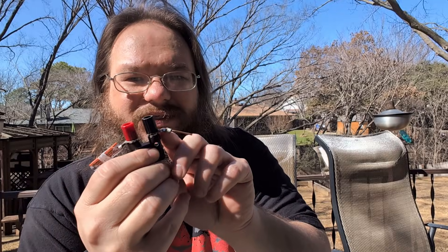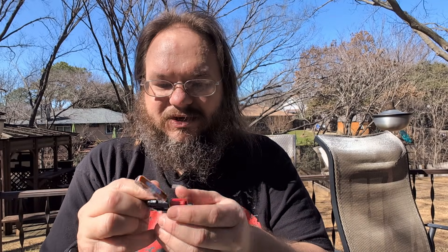Another failing point: the second time was at Field Day. I brought this antenna, went down to a quiet place by the lake, set up the radio and antenna, threw it in the tree, and found that I had cold solder joints. Thankfully, Robert — Digital Rancher Robert — had a soldering iron and came out to help me solder it together more securely. The other connector was fine, just one bad joint. After that, we were good to go.